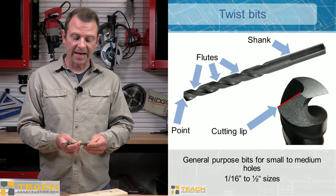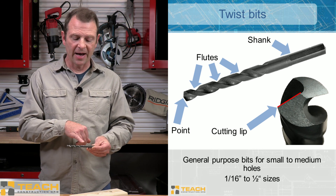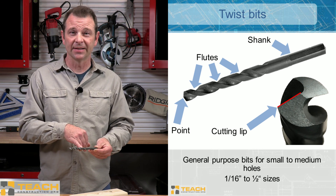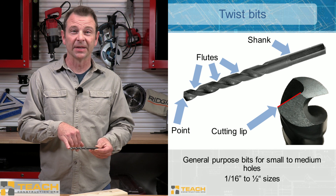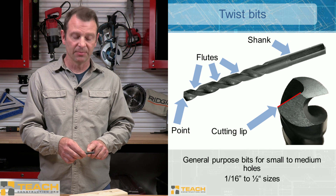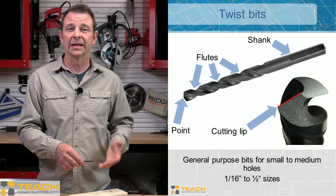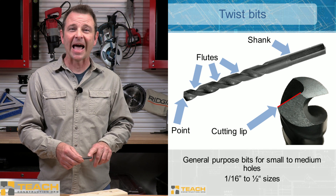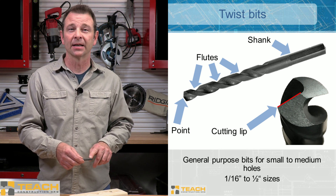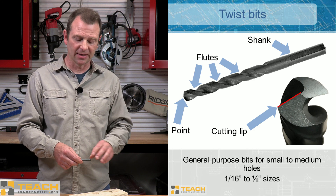To start with, let's look at a twist drill bit. You'll have the shank of the bit — this makes up the body of the whole part. You have the flutes that are cut into the bit; these will run from the tip halfway up the shank. The shank turns into a smooth shank on the end that fits into the chuck of your drill. It'll clamp in tightly. You might see some flat faces on this shank — those will help that bit not spin in the chuck.